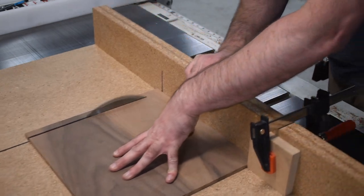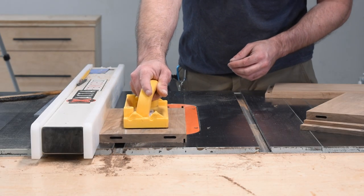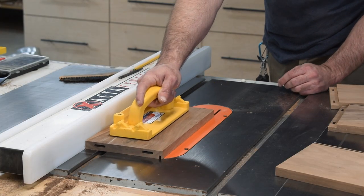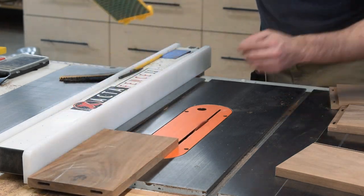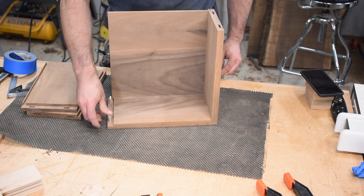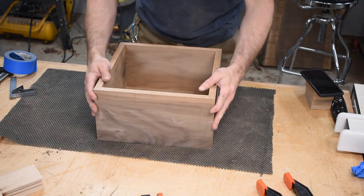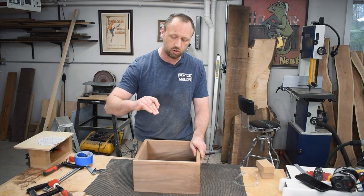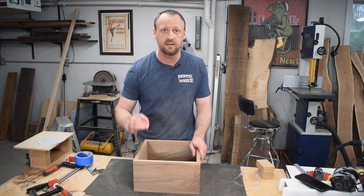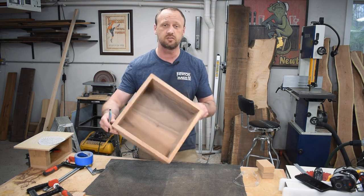I had a remnant of a walnut panel from a previous project, and I had just enough that would also work for this box. So I went ahead and sanded that down and cut it to the size that I want. Then I was able to cut grooves on the inside faces of all my sides, and then dry assemble the entire thing together, including the dominoes, to make sure it all fits. It looks fantastic — I really like it. So I'm going to take it apart, pre-sand the inside faces now since it's easier to do that now than later, glue the whole thing up, and then tackle sanding the outside.